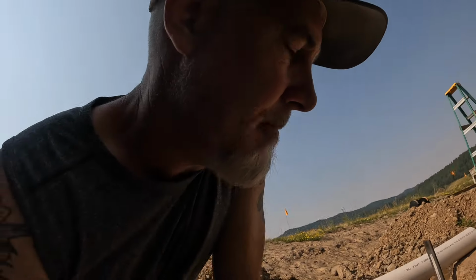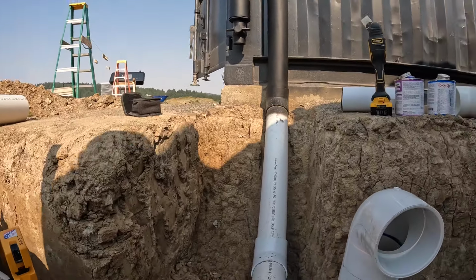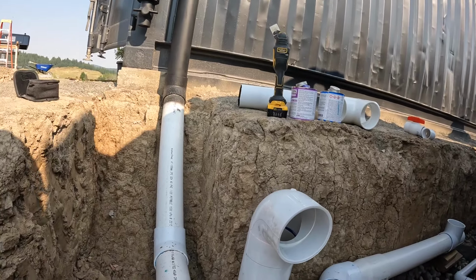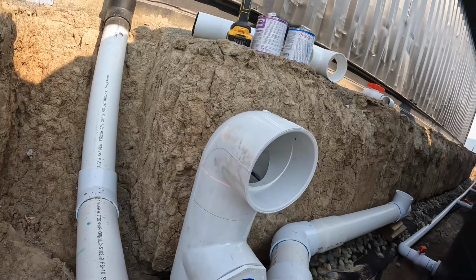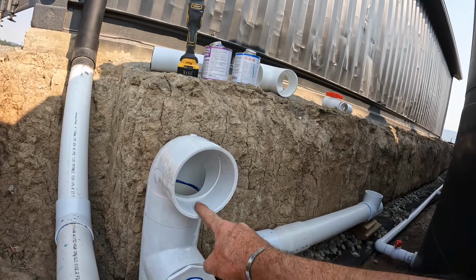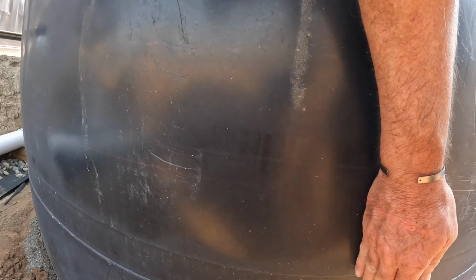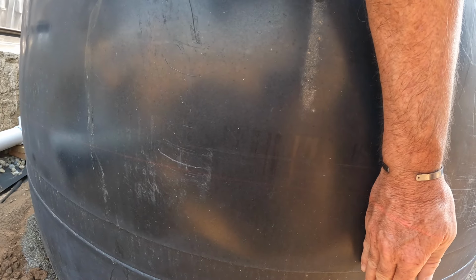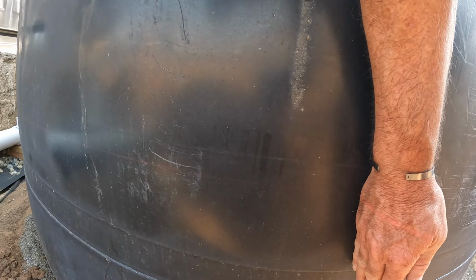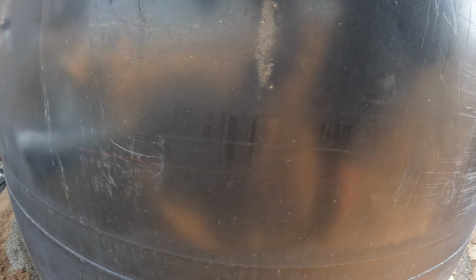Okay, so for us to get the level that this pipe needs to be at, we're going to backfill some dirt here. I went ahead and grabbed my laser, and I'm going to have it go over to the bottom of the pipe. You can see where the laser level is, right with the bottom of this fitting. And then we're going to laser a line over to here. I don't know if you guys can see that or not, but that is basically the height of the bottom of the pipe. So I'm going to go ahead and put a mark on the tank